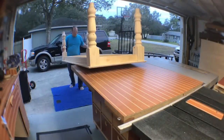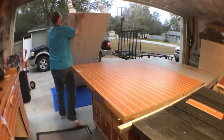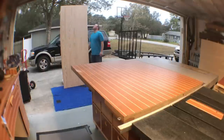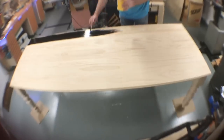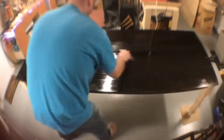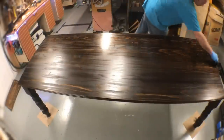I'm going to pull the table out and stand this bad boy up. Now I'm a little over six feet tall, about 6'1", 6'2", so you can get a sense of scale of how big this thing is. Now to apply some stain — I'm using a dark, dark stain. What I do is I flood the surface and let it sit on there for about 20 to 30 minutes. Typically pine doesn't take dark stain as well as I like it, but I let it sit and then wiped it off and I was very happy with the result.